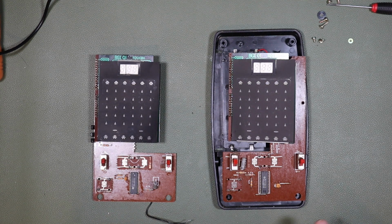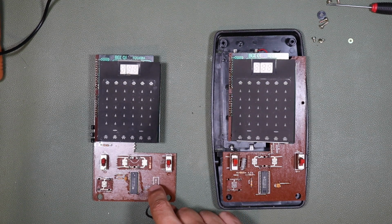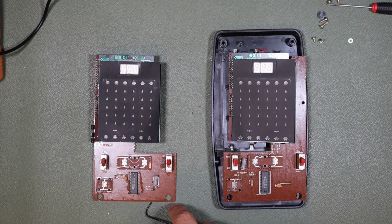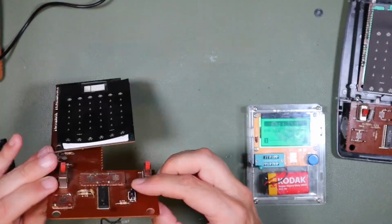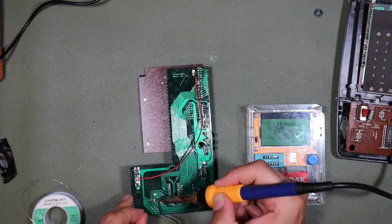But before I do any of that, what I'm going to do is change out this capacitor first of all, since it is across the positive and negative lines, so it would have potentially taken the full brunt of the 240 volts if somebody had been bold enough to connect it across there. So I did replace the capacitor. The one that came out, of course, tested good, and putting the new one in had no effect on the functionality of the game. It still didn't work.